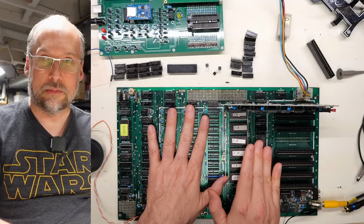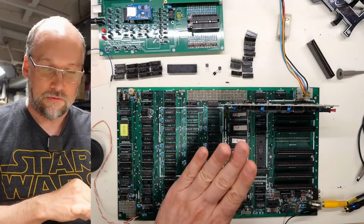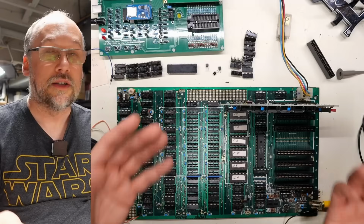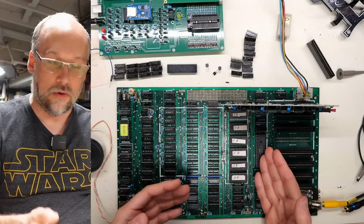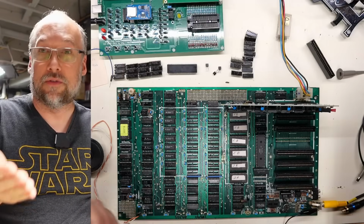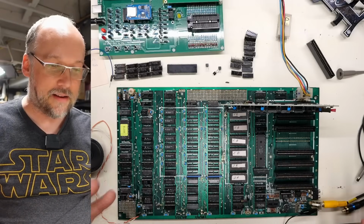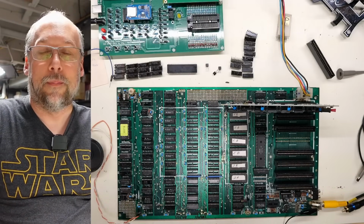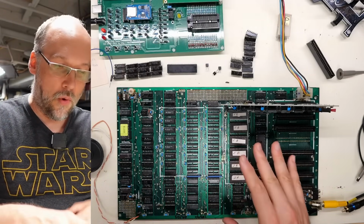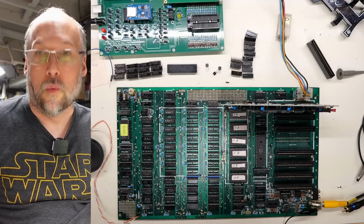But it is still possible to do some rudimentary tests of the memory subsystem from a ROM with some custom assembly code on the 6502 that doesn't rely on RAM or the 0 page or the stack. So I reached out to Frank, IZ8DWF, I've got a link in the description to his channel, and asked him, because he's a wizard, if he could whip up a little bit of a diagnostic ROM for this machine specifically to help me try to figure out what's going on.